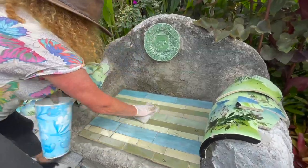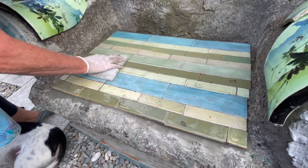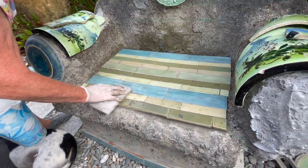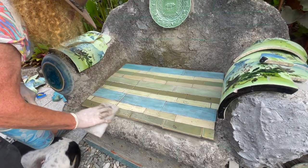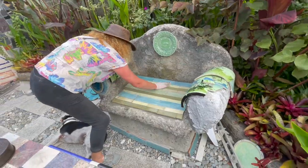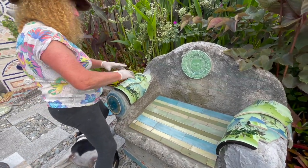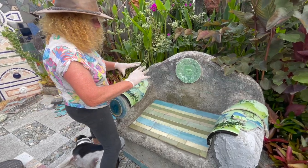Here we go, we've got our little cuts in, as neat as we need to be. The slower you can get the concrete or any concrete product to cure, the slower the better, but the stronger the cement will be. Here we have it. Throw a bit of water on it. Don't forget to do that. Don't leave any concrete work that you're doing in the blazing sun.